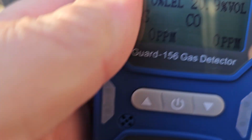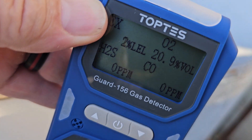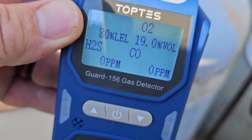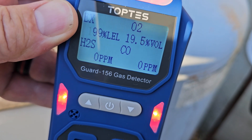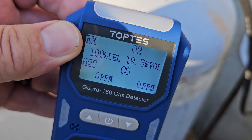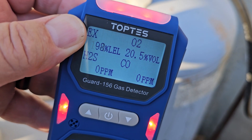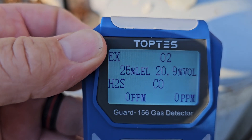So I'm going to run this by some propane here on the top left hand side. Now you can see that it's indicating the explosive level. It hit 100%, but again we're in an outdoor environment — just turned on our propane tank lightly to demonstrate this. I've turned off the source and you can see the level is going down.